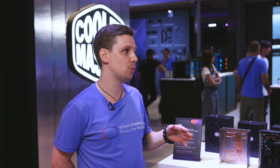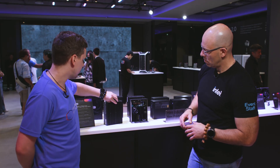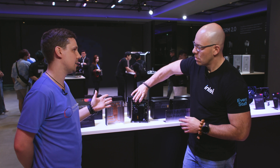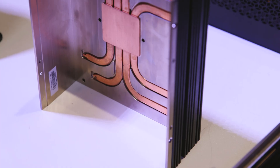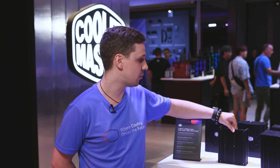The goal was to achieve 1100 watts on a fully passive PSU — previously only around 700W was possible. The key innovation is the backplate: a copper contact plate contacts the MOSFETs from the rear of the PCB, which are placed at the back as the hottest elements. Heat then travels through heat pipes into a passive radiator.